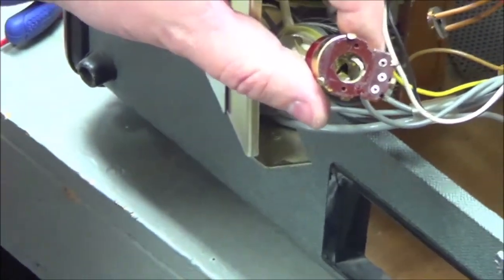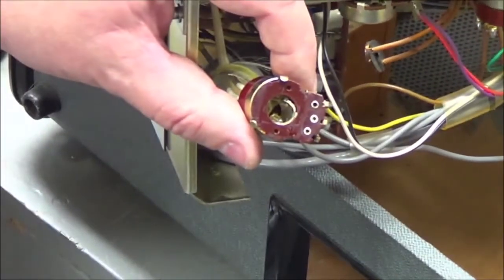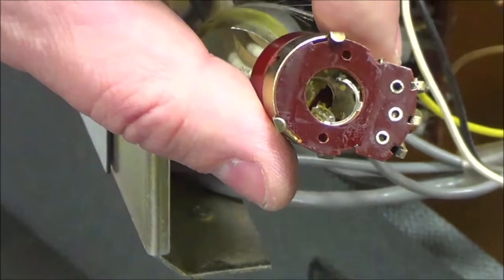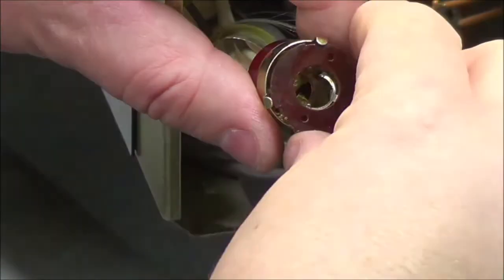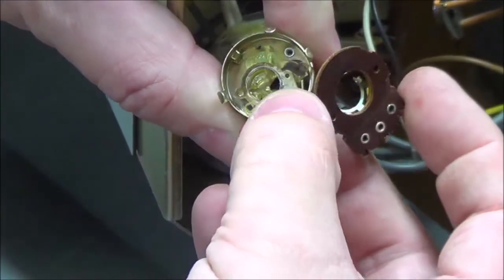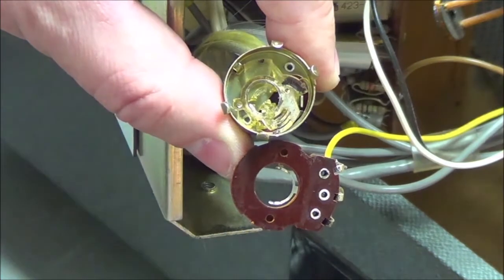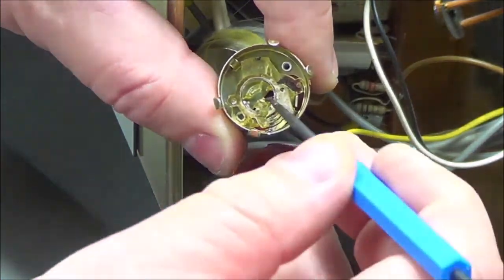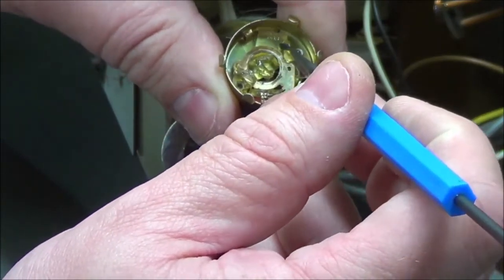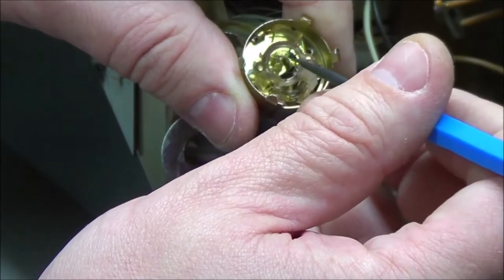And getting back to the potentiometer, as I try to once again figure out which way's up from the opposite direction of view, you can see, there we go. You can already see there might be something wrong on the inside. So there it is. All that looks like goo, but it's actually clear plastic. It's yellowed a bit, but it has gotten brittle. And here I am, I got a poker in there. It's all shattered. You know, the plastic's all shattered. So that piece is going to be a puzzle.